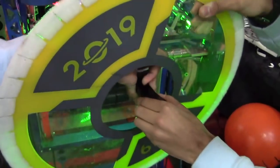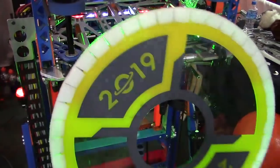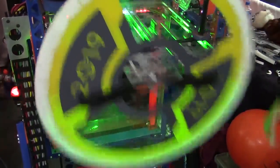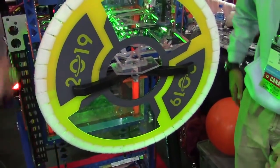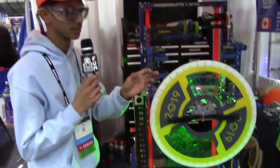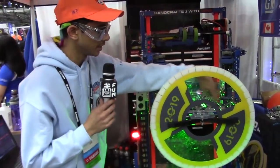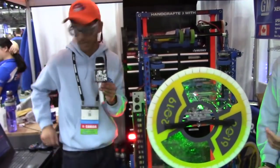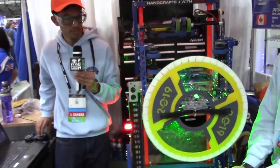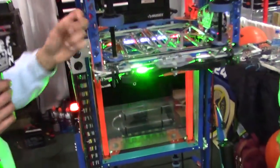So you can put it in, and then this entire tray over here comes out. The reason we do that is because the cargo ship has the bumper cutout and the rocket doesn't. We want this hatch mechanism to come straight up flush to the rocket ship. The claws open up, and we have two ejector pistons here just to center the disc as it goes on to the cargo ship and the rocket. You can see it eject here. It's all automated — once it ejects, the tray and everything will come back in so the driver doesn't have to worry about that.